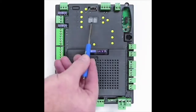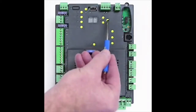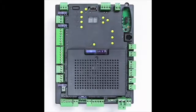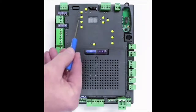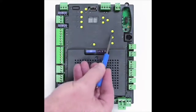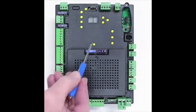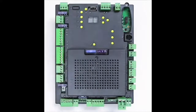This dual 7-segment display in junction with the 3 navigation buttons beside it will allow you readable cues to easily navigate the straightforward 4-button program tree, as well as provide you with system status indicators for ease and troubleshooting. This control board has a 3-button station for open, stop, and close commands, along with a hard shut down reset button and a dedicated learn command button.